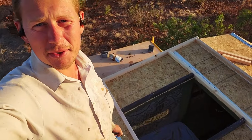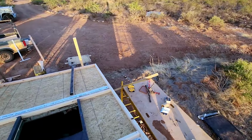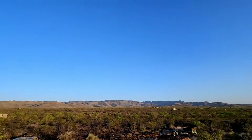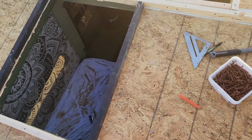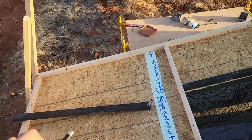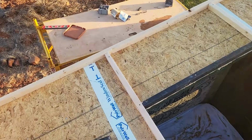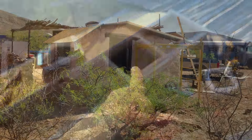All right, I'm wrapping up today. Been spending a lot of time on roofs lately, it seems, but got quite a bit done. So got all of our sheeting on. It definitely feels a lot sturdier up here. I think some of that under stuff got pretty gross just because of a couple years of water damage. Started getting our framing up here so you can kind of see what we got. So basically reframing this whole thing out with 2 inches of 2x4s, ripped down from 3.5 inches, and framing out our skylight.